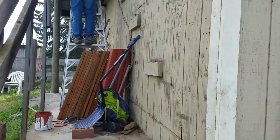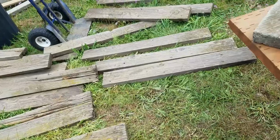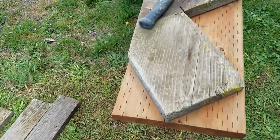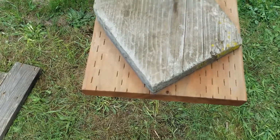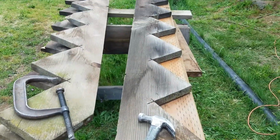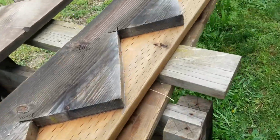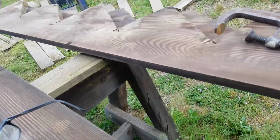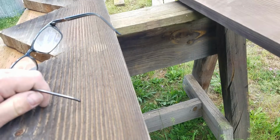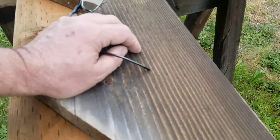It's a level landing. You can see how it is tapered. It's going to work out just about right to just copy the stair stringers that were there. So we clamped the old stringer down to a new 2x12 treated. The original stringers were just regular wood, fir I think, but anyway, we clamped them down so that they were straight with each other.